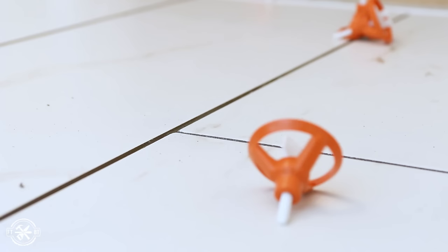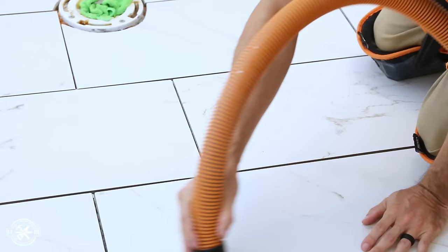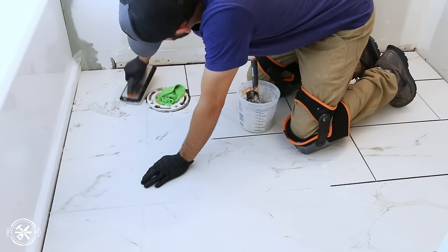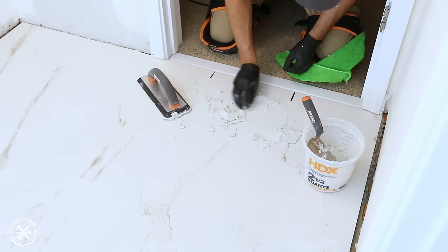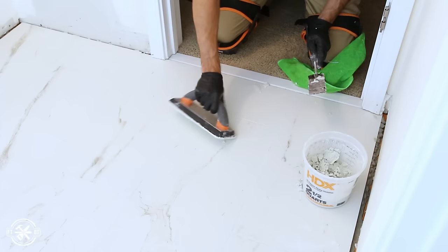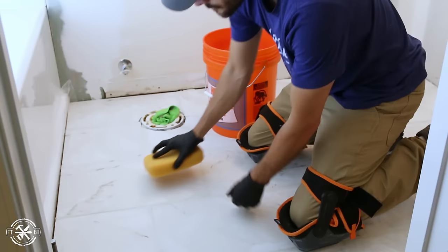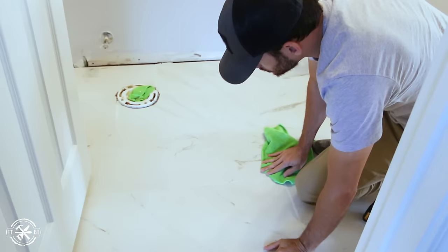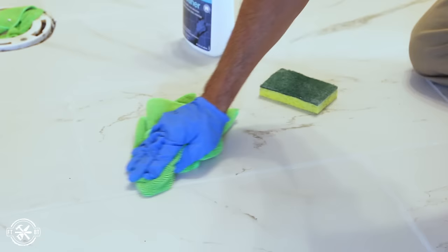I cleaned up the joints of any excess or loose mortar and vacuumed everything clean. We went with a light grout to try and help the grout joints disappear and have the focus be the tiles. I mixed the grout by hand — with large format tiles you really don't need a lot of grout at all. I worked the grout into the joints using a grout float at a 45-degree angle to the joint. If you push the grout in parallel or perpendicular with the joint lines, the edge of the float is going to fall in and catch and pull the grout out. After filling in all the grout I rinsed the excess off with a damp sponge — ring it out well so the grout doesn't get more water, because extra water can cause discoloration and weaken the joint. I let the grout dry overnight and came back the next day to buff off any grout haze. There were some tough spots where I had to use a haze remover to get it off, but it works well with a microfiber towel.